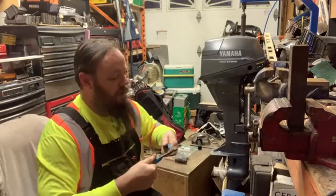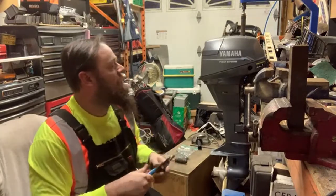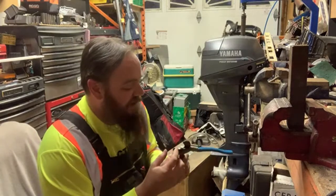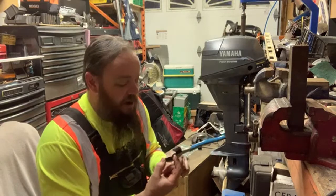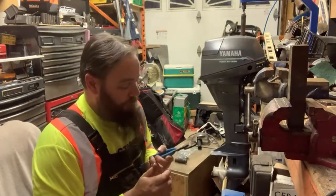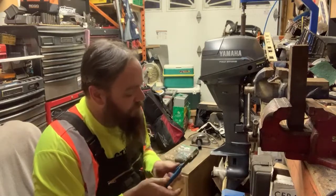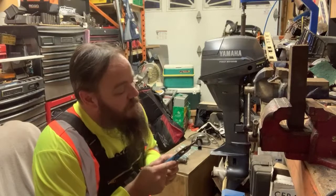Now these cable cutters, like I said, I've used them for hoses and stuff, but these surfaces cause me grief. I have taken a file and filed down this surface so that I can use the entire blade on this cutter to my advantage, because right now I can only do up to a certain size. For hose, it's about a 1/2 inch. But I want to cut 3/4 inch hose or 1 inch hose or even more.